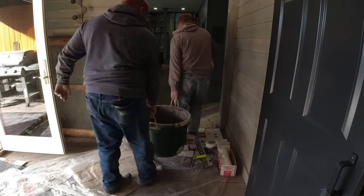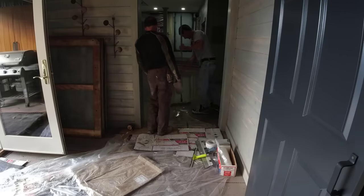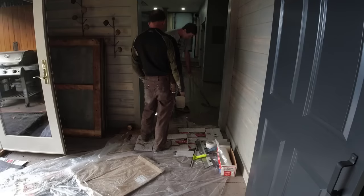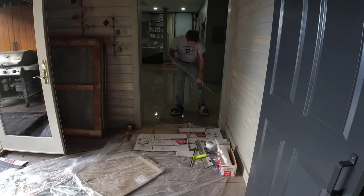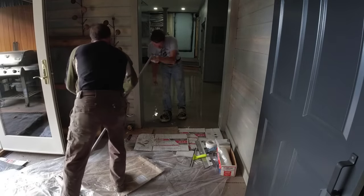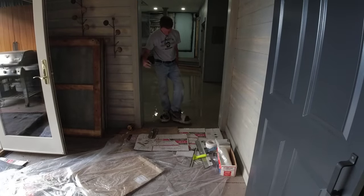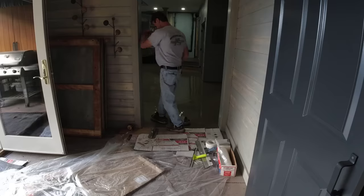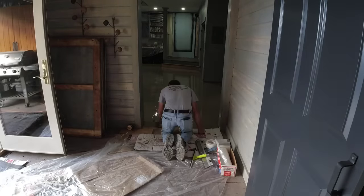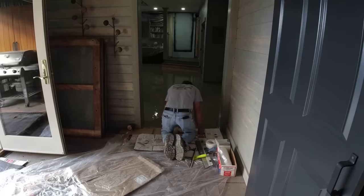What we found out — and you'll see here at the end of the video — is when we went back the next day and looked at this, it really smoothed out really nice even over those pitted areas. There really wasn't any resemblance of any dimpled areas. I'm working my way right back to the door, making sure I'm staying down a little bit on that entrance way — the breezeway part — because we're going to end up matching that level with the stampable overlay. So we're keeping that down about a quarter to three-eighths of an inch.